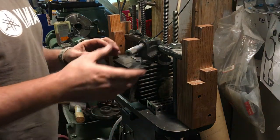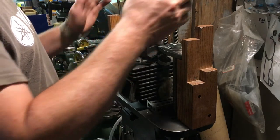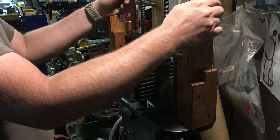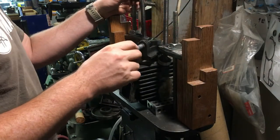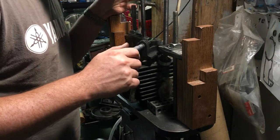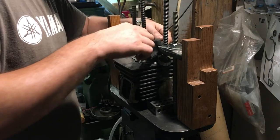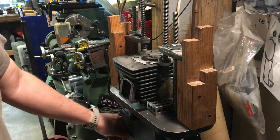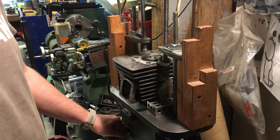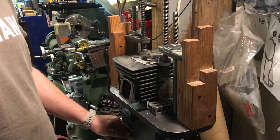I like everything I saw on the test pass — we're square and looking good. I'm going to make the first cut. I'll divide the remaining distance roughly in half since I like to cut about 20 thousandths per pass. There's not 40 thousandths to cut, so this first pass will be at 2.538. Then we'll make one more pass to the final dimension. Don't leave the machine when you first start cutting — if you get chatter, you can turn it off. That's cutting good.